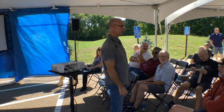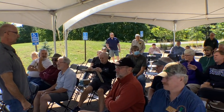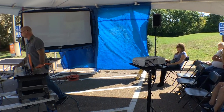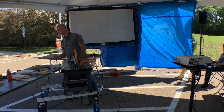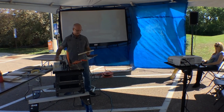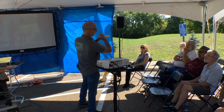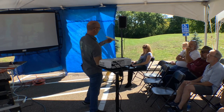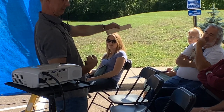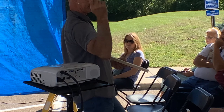So what else do you need to be worried about? You were talking about cutting the cap in grain direction. Are there ways that I need to be more concerned about supporting this? Well, there's some interesting stuff going on. The end grain cut's not a big deal. But on your long grain cut, given the opportunity, here's my grain, so that cat wants to get petted this way. If I can feed this piece past the cutter like this, that optimizes my surface finish. You can also zero clearance your in-feed fence like we talked about with the slot cutter.